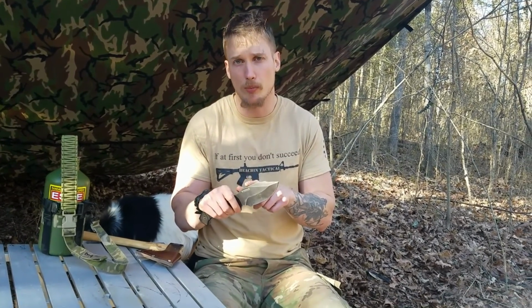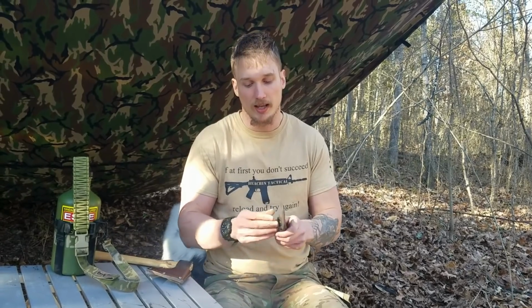Huge carbides, natural stress fractures, literally the worst decision anybody could ever make on a knife steel. But I'm assuming that Freeman Outdoor Gear works with it often, and it still sells a lot. It sells easy to people who don't know any better, probably because of similar marketing from the 80s as the hollow-handled knife. The knife community as a whole is figuring this out. Everybody's moving away from D2. Everybody's realizing that the marketing is marketing. But it has to have this thick edge or these would be breaking left and right.